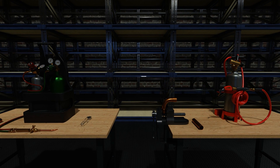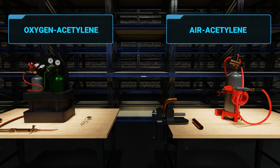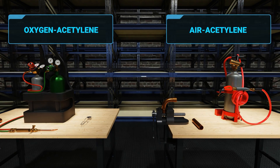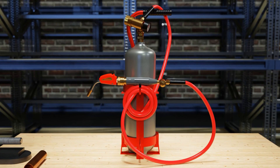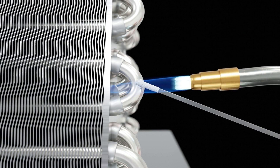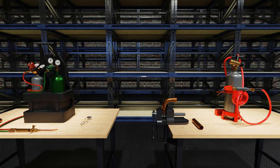In this video, we're going to show some of the differences between an oxy or oxygen acetylene brazing rig and an air acetylene or air swirl brazing rig. Both of these setups can be used for both brazing and soldering in HVAC applications, including the repair of aluminum, although I prefer the air acetylene for that purpose. Here we're showing a turbo torch air swirl brazing rig because that is the type that I use personally.